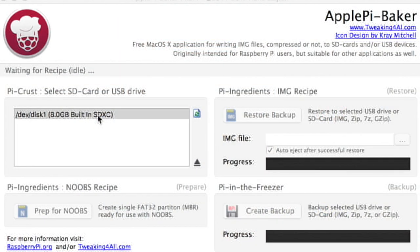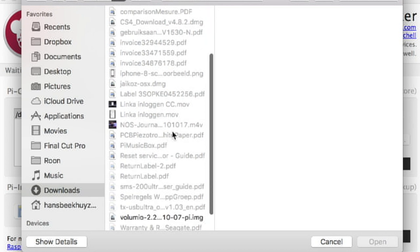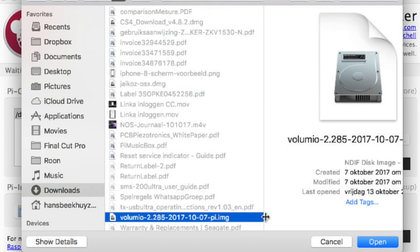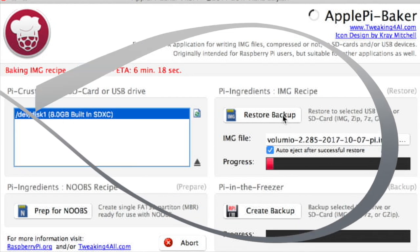Win32 Disk Imager or PyWriter will ask you what SD card to use, then what image to use, and ask you if the copying can be started. After a few minutes, the program will report it has finished. Take the micro SD card out of the computer and stick it in the card holder on the Raspberry Pi. Connect the power supply to the Raspberry Pi and wait for it to boot.